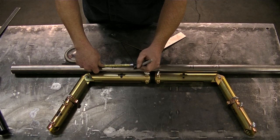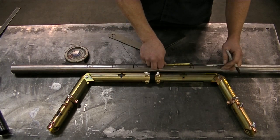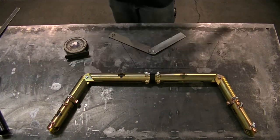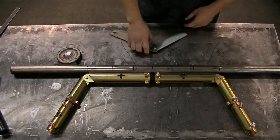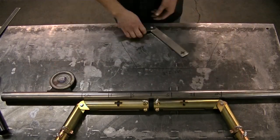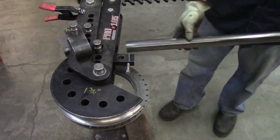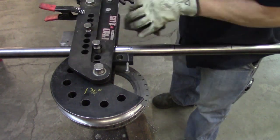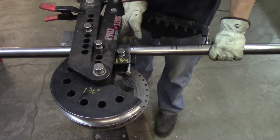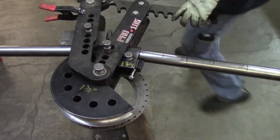Lastly, I'm going to add the bend offset for my bender, which is the distance to the mark on my bender where I start the bend. That's the easy way to do a bend layout—transferring the center line to tangent point using an angle finder. Then I'm going to transfer the bend angle to a larger angle finder. Okay, load this in the bender. You've got center line, tangent, and the start mark that lines up to the little mark on my bender. This is also the U-strap that holds it in. Add a little oil and start bending.